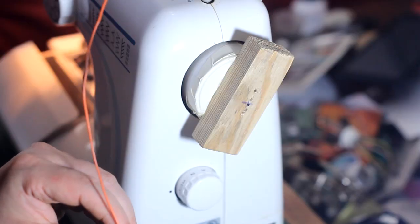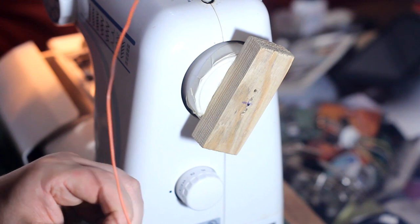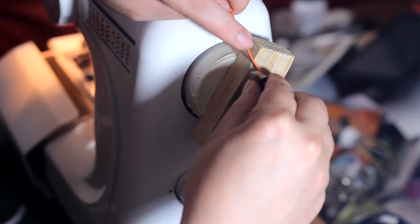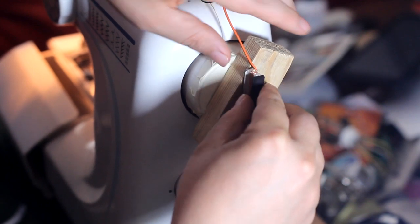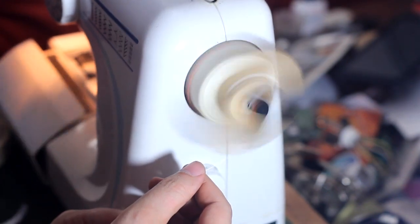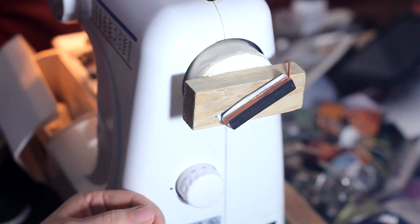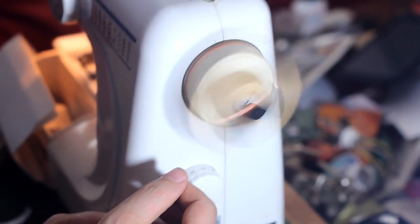Here we got our winding machine, which is actually a sewing machine with a piece of wood stuck to it. If you are familiar with my channel, you know I've gotten some awesome pickups off of here. Just gonna stick a piece of double-sided tape on the back of the pickup bobbin, smack it up there, start spinning it. And you can see I don't have a traverse bar or anything, I just concentrate on that wire and move it back and forth. Do my traverse back and forth. Feel the tension. How's it bouncing? How's it pulling through my hands?